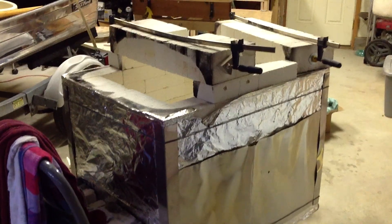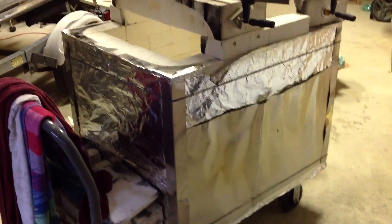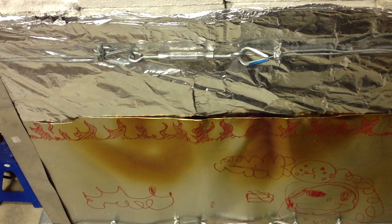Single layer IFB brick — the aluminum foil stops leaks, or helps prevent air leaks. It's reinforced with cable that goes around the stainless steel angle pieces, which are just what I had on hand and are there to help keep the cable from digging in and breaking the brick. The cable goes over to these clamps and I can tighten it as I need to, which helps keep the whole piece together.